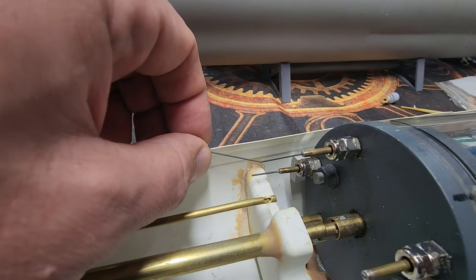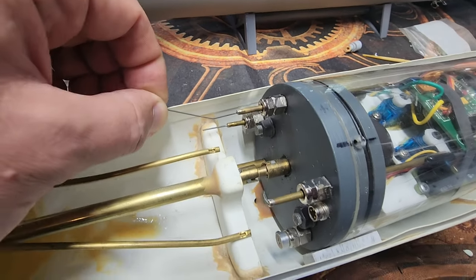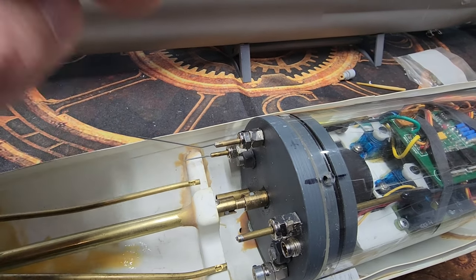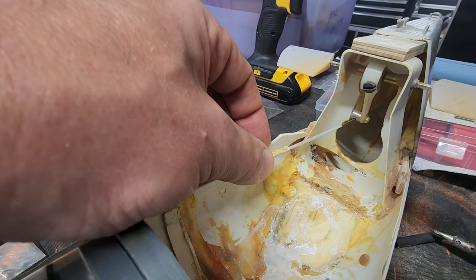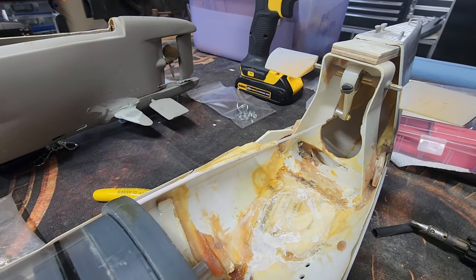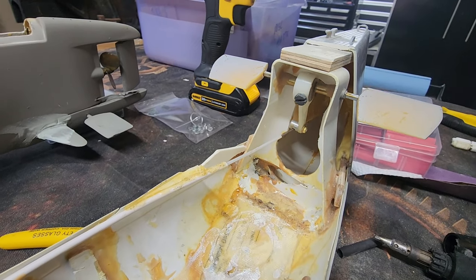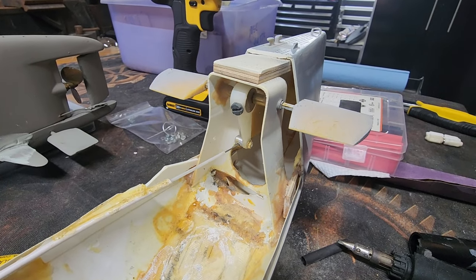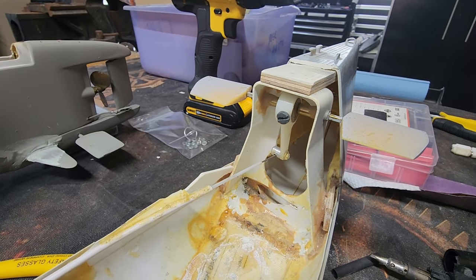This is the linkage for the forward dive plane. So it comes out the side of the boat, runs in that sleeve. I'm assuming it clips with a, you know, like a wheel collar there. But here's the challenge. Goes up in the front. Now, this used to be secured to the hull right here. I knocked out that support and everything. This is the issue. Super long horn. So this is the full travel of the dive planes. Like nothing. Like 5 degrees up and 5 degrees down. Not well thought out.